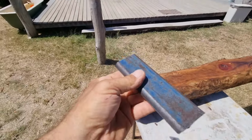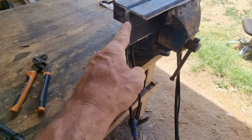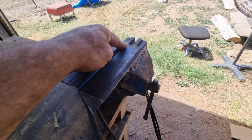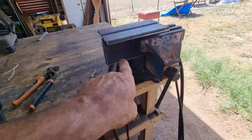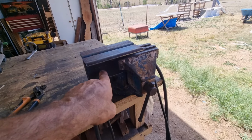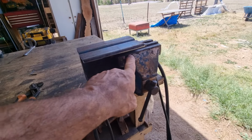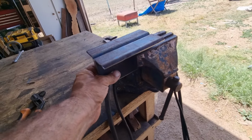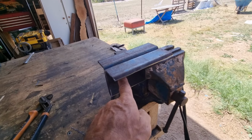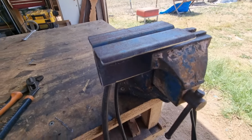So first of all, let's get these cleaned up and welded up. Get that spider off me. I'm going to tack weld here and here. Then I'm going to drill probably three holes, maybe two holes there and there, so they correspond perfectly. So when that's then re-put together and I drill through, it will locate in the tenon of the beam perfectly.